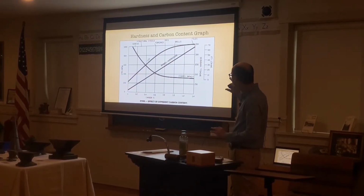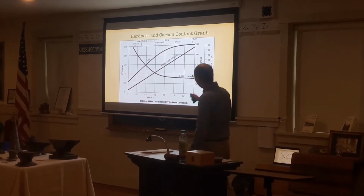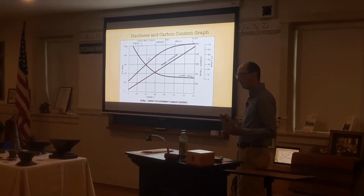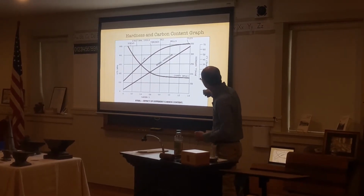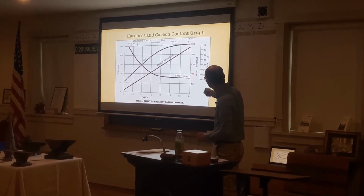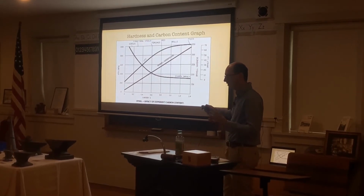And I won't talk a whole lot about the different percentages. It's a lot of math and science. But basically on the level here, we start off as a soft piece of metal down here, Brinell hardness. The harder the piece of metal is, the more brittle it's going to become. You can see impact here. So as you increase the carbon percentages, the more carbon elements that you add into the piece of metal, the harder it will become.